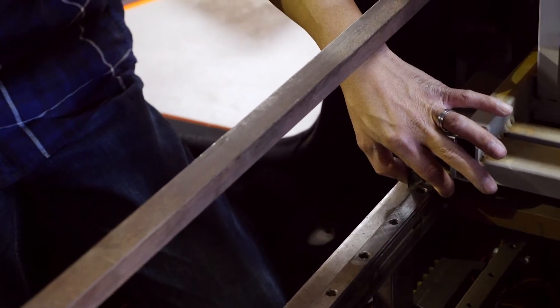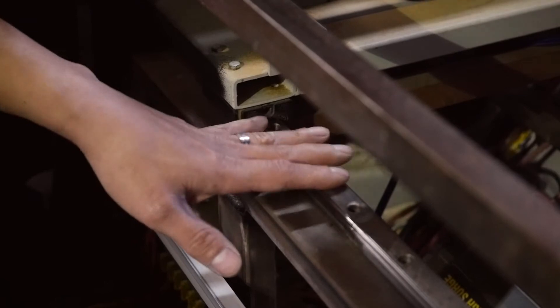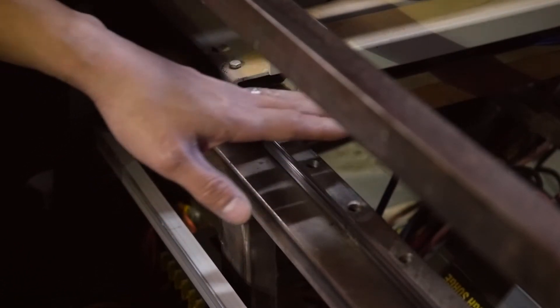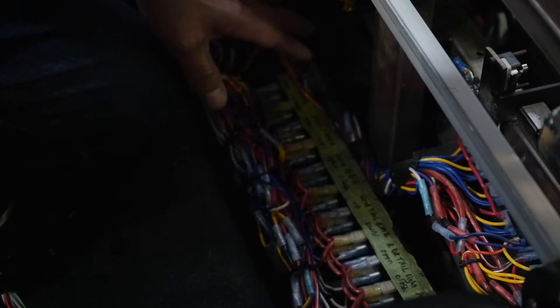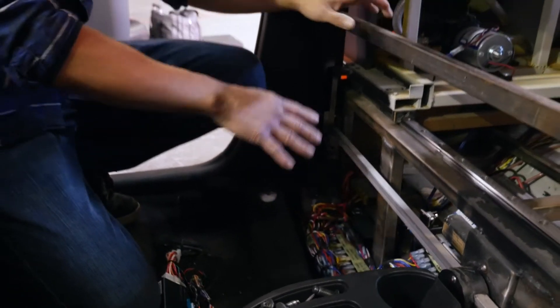Here are the bearing blocks. These are very precision and very expensive. If these weren't greased up, you'd see a whole lot of rust because they're made out of steel. These are rack and pinion drive motors — these also have to be greased properly. There are 50 relays right here, and we want to make sure all the wiring is correct because this is the brains of the whole system.